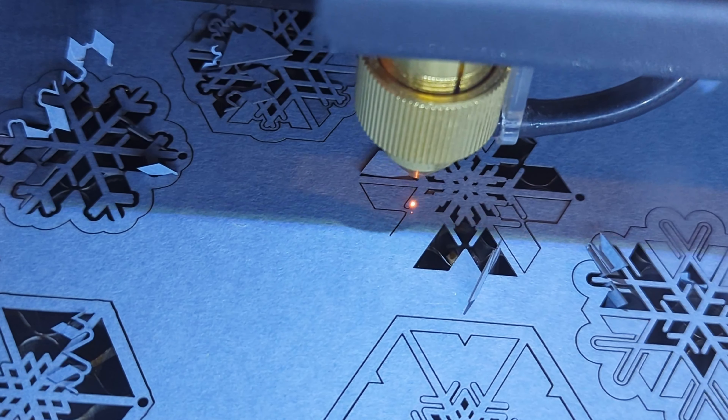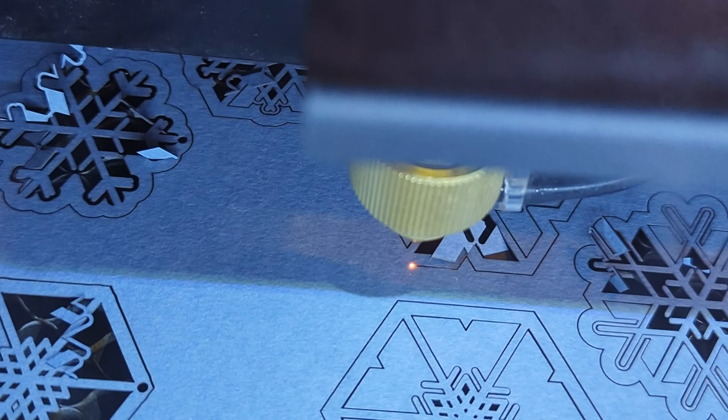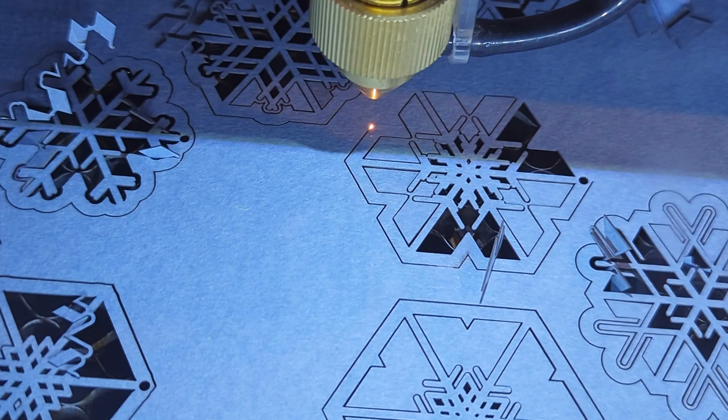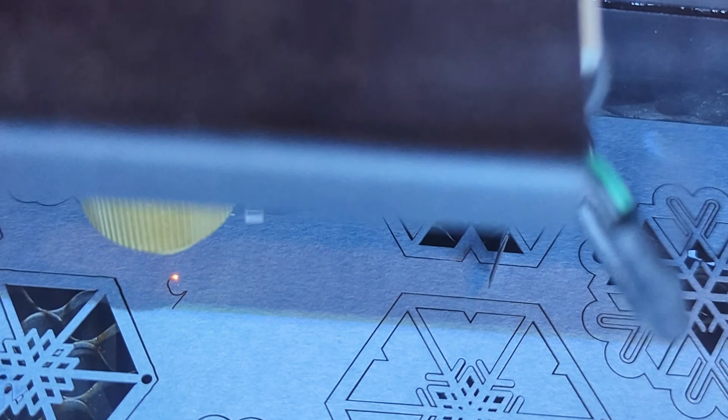If possible, it's great to tune it so that the paper stays in place but is loose enough that you can break it out by hand afterwards. But that's actually really hard to tune and I prefer to have it more on the loose side than needing a knife or scissors afterwards. This comes with one problem though — bigger loose parts of paper might fly around in your laser cutter and cover up parts where you are currently trying to cut. So be careful with that, and of course never leave your laser cutter unattended.